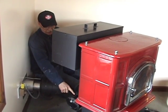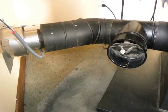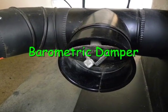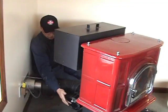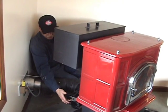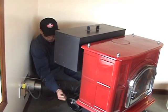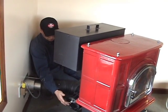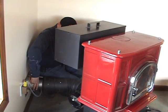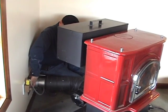This unit right here is attached directly to the flue on the stove. This is what we call our barometric damper. There's a weight setting that determines the draft pull that swings the door open. This is to keep from pulling too much draft and pulling the heat out of the stove. Then it comes over — you cut a 7-inch hole through the wall and slide your power vent in from the outside, then slide the flange up over it from the inside and you're installed.